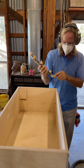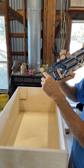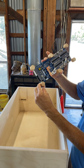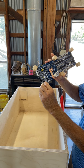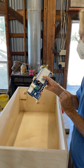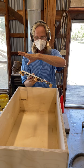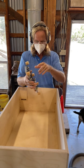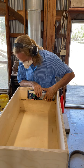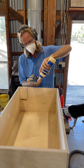And I had to be very careful how I put them on this end. There's a little solder joint here, a pin connector here, and here there's a little resistor and another tiny little resistor. So I've snugged it up close to them, marked the holes, and put some number 6 by 1/2 inch stainless screws to put them on. And I set them all up like they were going to be when it's done. Then I'll fasten this in. Then I'll remove the BMS for the finishing process. And then I'll be able to put it back onto those same mounting holes later.